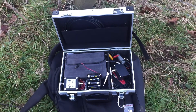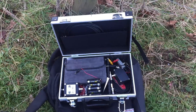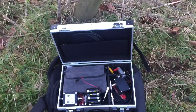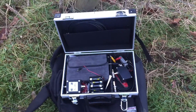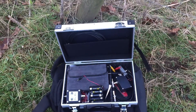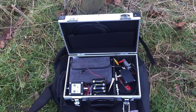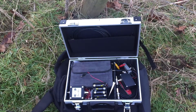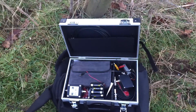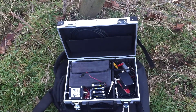Against the Wellbrook LA 1530, and yesterday against a 30-meter long wire. Being an e-field antenna, all it really does is amplify everything - it amplifies the noise and the signal - so the Wellbrook won that test very easily against a long wire. On long wave the Bonnie Whip performed better in terms of signal-to-noise, but everywhere else the signal-to-noise is about the same as the long wire, because the signal and the noise are both being amplified, so you don't hear any signals more clearly.